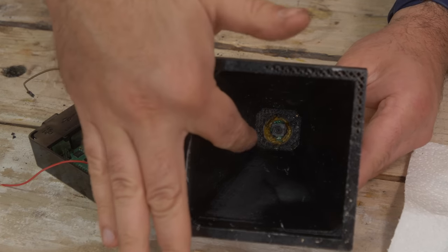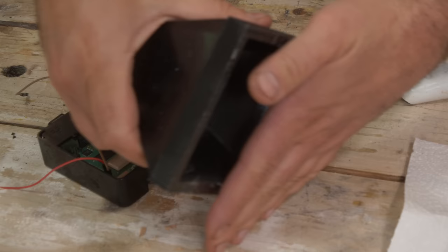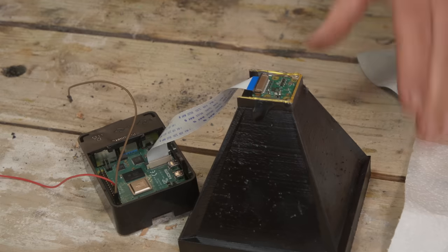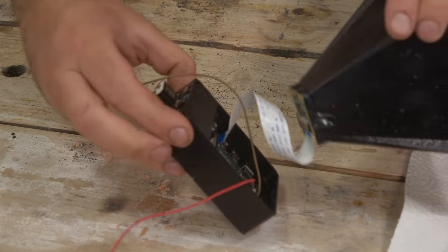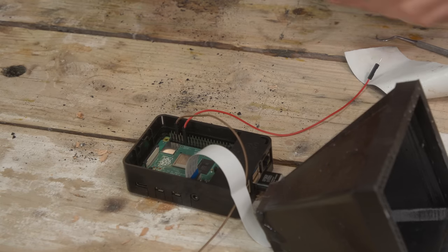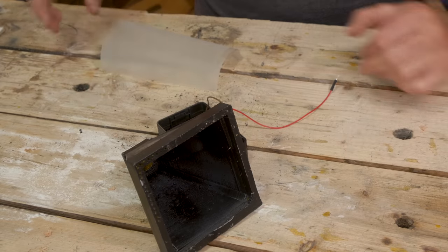So I was going down a rabbit hole possibly using a Raspberry Pi, and then I realized — what is a scanner? It's just taking an image of a document. Ultimately the best result I found was to put a camera pointed towards the ground glass where the image is being projected onto by the lens, and just take an image using that. Basically it's a scanner, and that's going to the Raspberry Pi. We have it hooked up to a little program so that people can just press a button, get a photo preview, and upload it to Instagram. This has a lot of advantages: it's a lot smaller, it's quicker, and you can actually do a live preview. This is basically going to be a digital sensor with the ground glass on top.